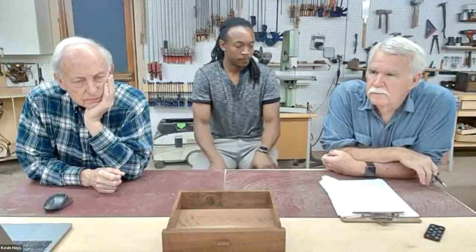Okay, but that didn't help my problem. I know this sounds really dumb, but could I glue a 1/2 inch piece and another 3/4 piece, because it'll end up being thicker, and then sand or plane it down? We do it all the time. If we need a 3-inch piece of wood, we glue up, stack it until we've got our dimension, and then work it out. Or buy the rough wood.